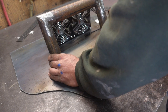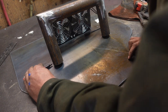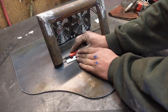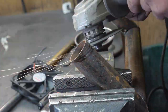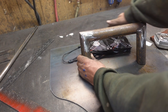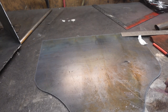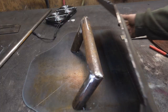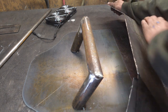So the way I'm going to get that pitch right — tack it, and I'll just mark it with the Sharpie just like this. I need a little bit of a block. Now I have right where I need to cut it to keep it at that pitch. Now what we need is a backing piece to cover this back edge. I got to start laying these things out to figure out how it's going to work — so this goes right here, and this guy will bridge the gap from top of pipe to the back of the plate.